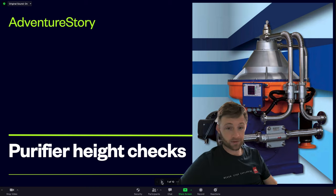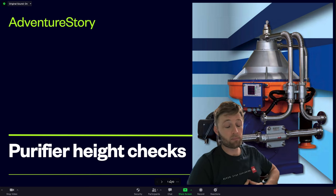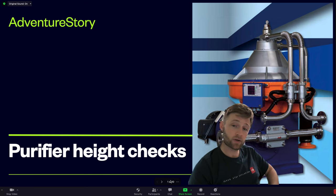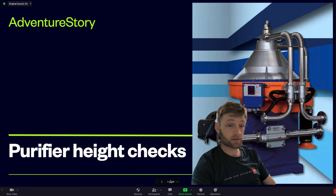Today's video will be about a Mitsubishi purifier. I would like to inform you that purifiers can vary — the transmission may be by gear or by another medium like a belt — but the principle of operation is the same. The centrifugal force in this kind of purifier is really tremendous because we have rotating speeds from 7,000 to 10,000 RPM.